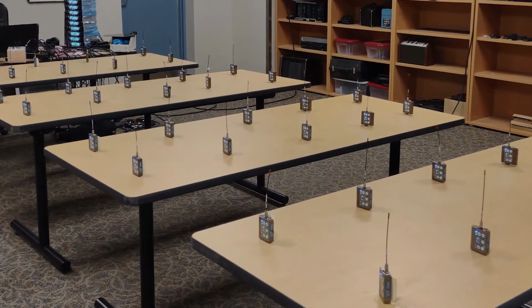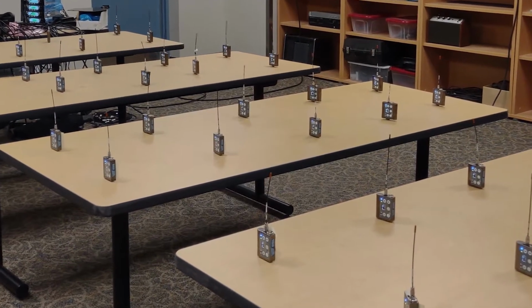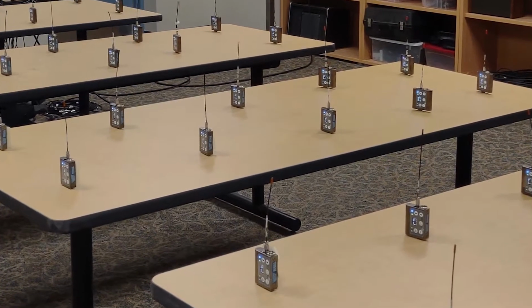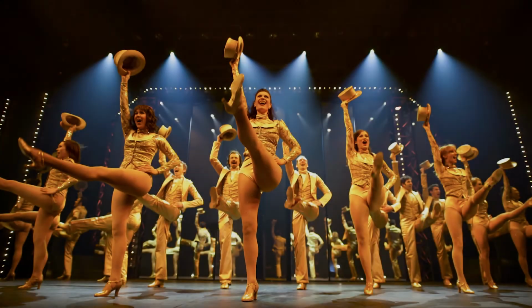The design goal was to allow more than 24 channels into 6 MHz or less of clean spectrum with excellent sound quality and reasonable range, and we've achieved that. Because of the lower RF power, this mode is likely to be most useful in a controlled environment like a studio or stage, where you can optimize antenna placement and ensure correct RF gain structure.